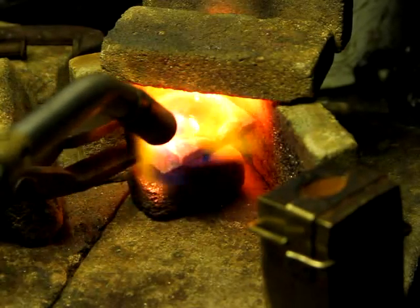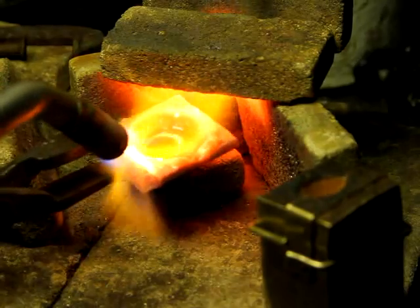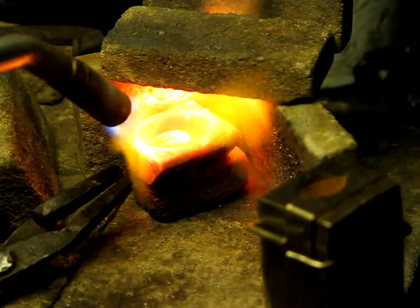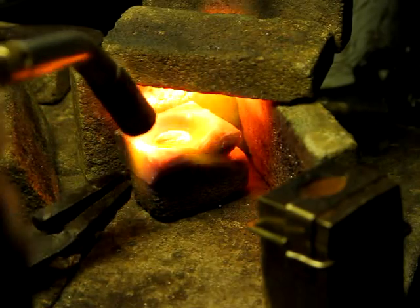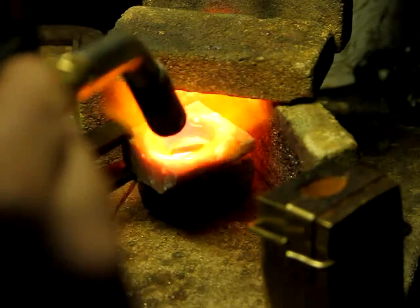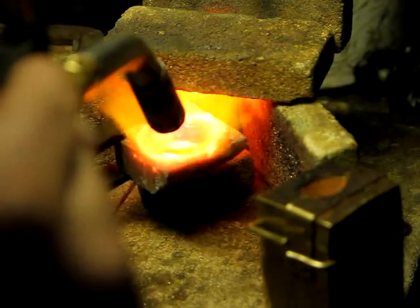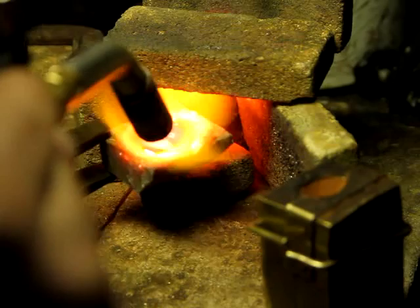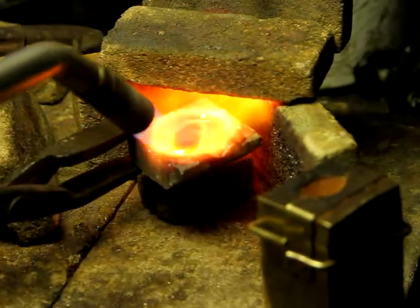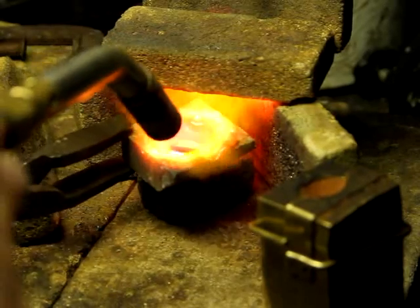It's just beginning to be liquid. Now we're at liquid. I'm just going to turn down the gas so you can hear me a little bit better, because the metal will stay molten now. With a bit of experience, you'll work out how hot the metal is by how fast it moves. I'll just give it a bit of a shake to see, and to check that all the granules have melted.